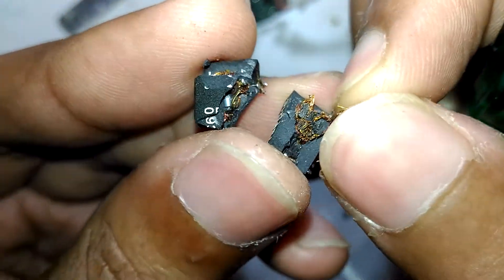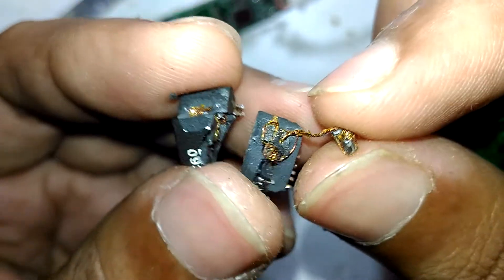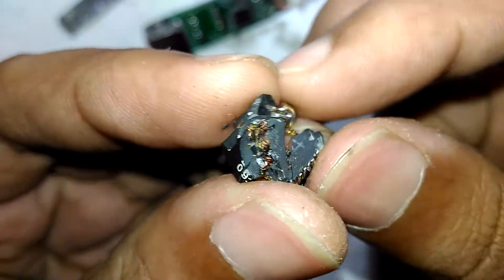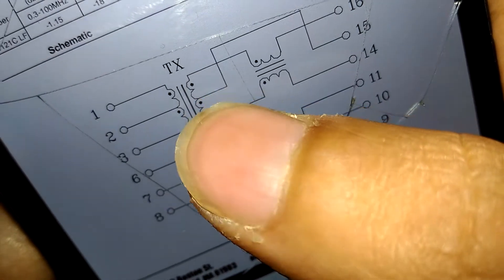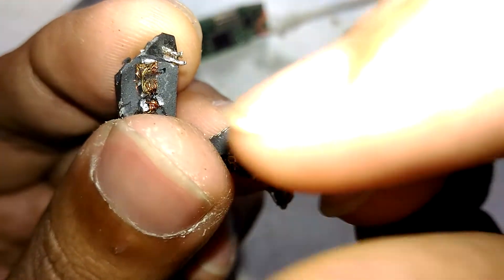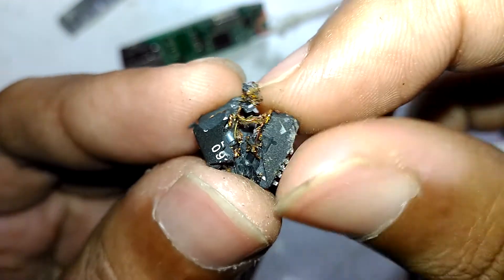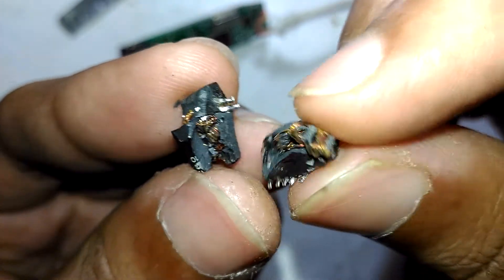The wires are just wrapped on a toroid, so it basically looks and acts like the transformer you find on CFL circuit boards. So that is what's inside an Ethernet isolation transformer — a couple of toroids wound in a specific pattern. This thing has four toroids inside: two of them are the line filtering chokes and the other two are the actual transformers that transfer the data. That's what's inside a 10/100 Base-T Ethernet isolation transformer.